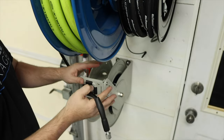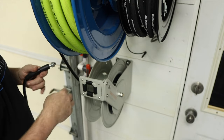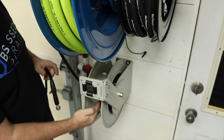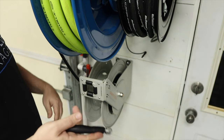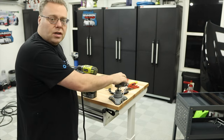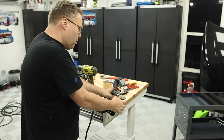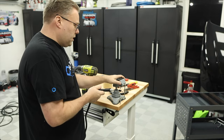I went and did a bunch of stuff and didn't realize I wasn't recording. I removed the plastic shield — just two bolts and a screw on this side — and there was a little loop around here holding the hose to the base, also two bolts and a screw. I unbolted the hose from this side; it's just a swiveled bolt. We're going to use this compression vise — basically a suction cup cube — which works really well for crimping the hose.